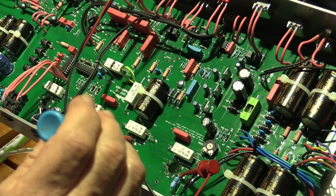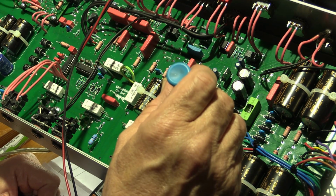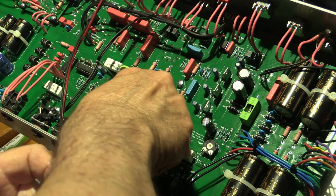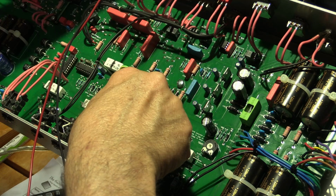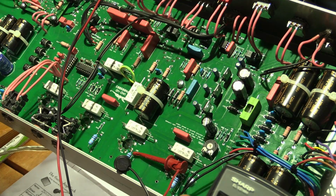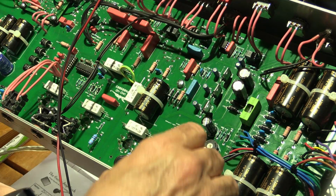Then he's going to trust my ear to let him know if that one weaker tube is making an audible difference. That's just slightly higher. Plate voltage is now 477. And it's 38, so let's see. 477 by 0.038 divided by 28. 65%. I'm really happy with that.